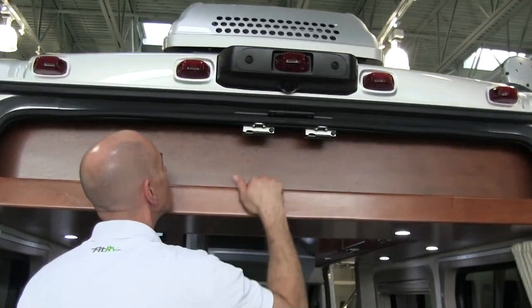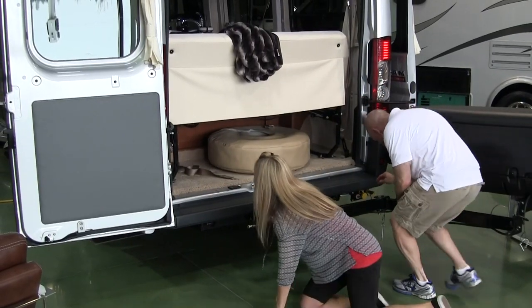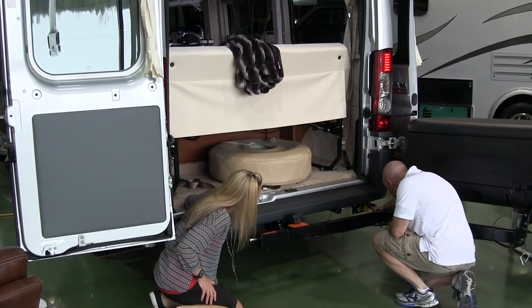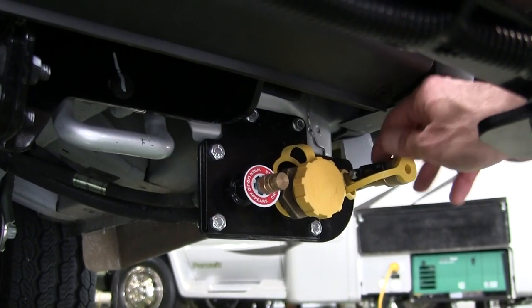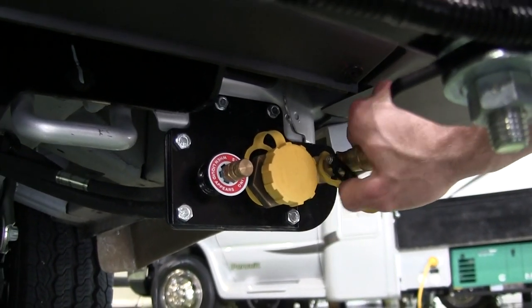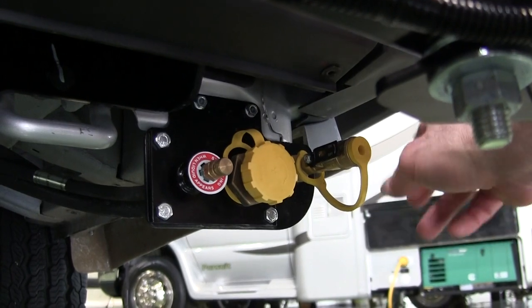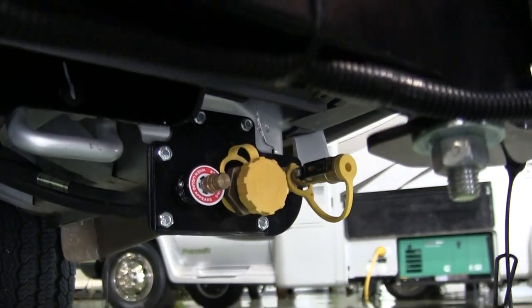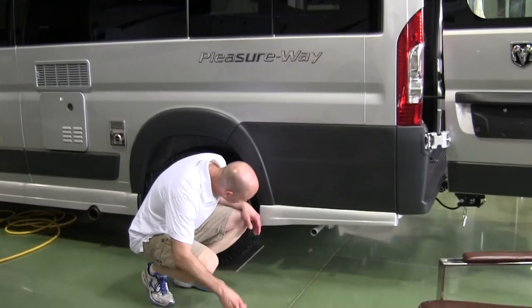That storage up there is interesting too. Here's a close-up: that is a barbecue quick-connect with an on/off tee and the propane fill. Our grill wouldn't work with it because this comes after the regulator — you need a grill that doesn't have its own regulator.